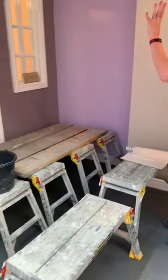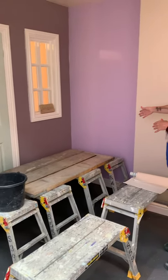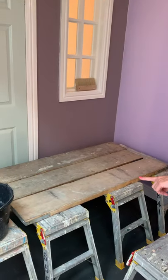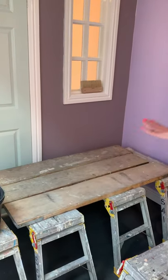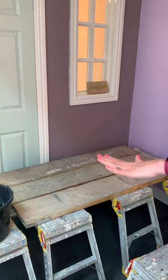When you're papering a ceiling you need to set up a rig. You need to be able to walk from one side to the other safely — we don't want any trap ends and we don't want any gaps. So that there is all platformed out if you like.